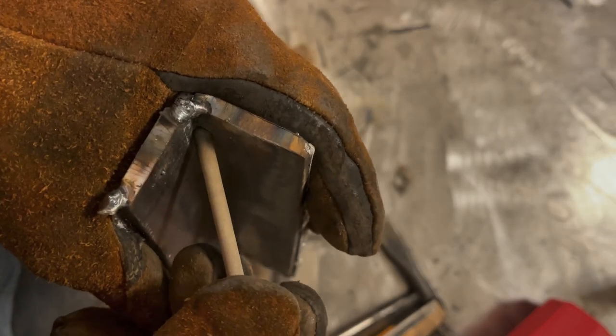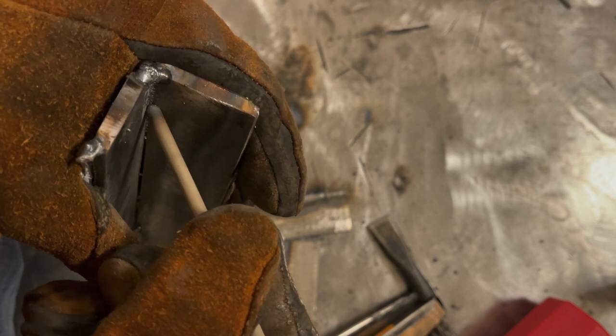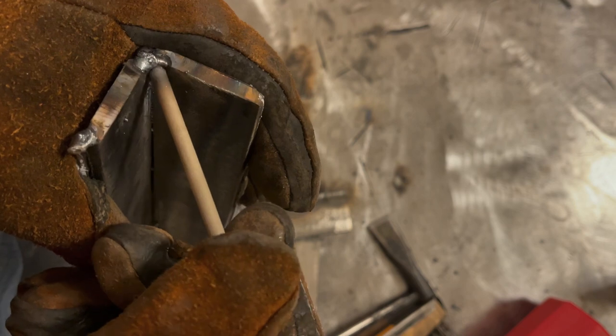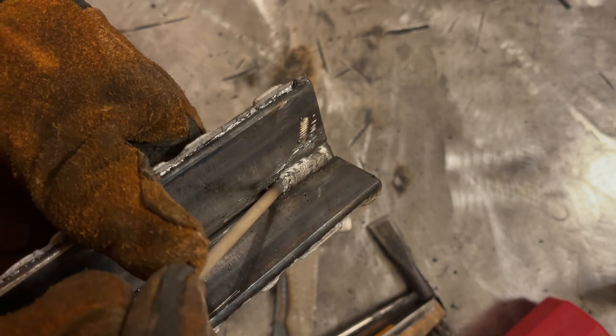So part of the reason why this is swirling all around is simply because your arc gap, despite shoving this rod down in here, is just entirely too long. One way you can help take care of it is to up the amperage, which will burn more flux off and will reduce the arc gap, which is why over here you can see our end result is better than it was. The first couple shots at it's better,